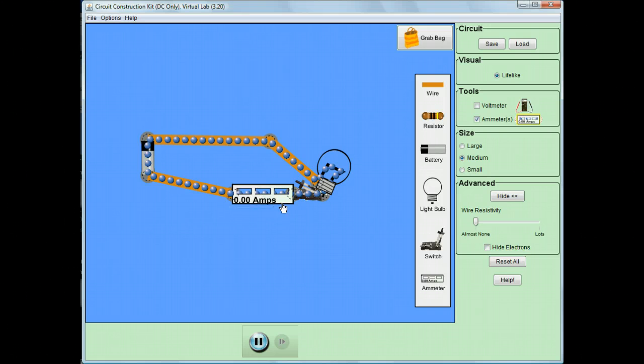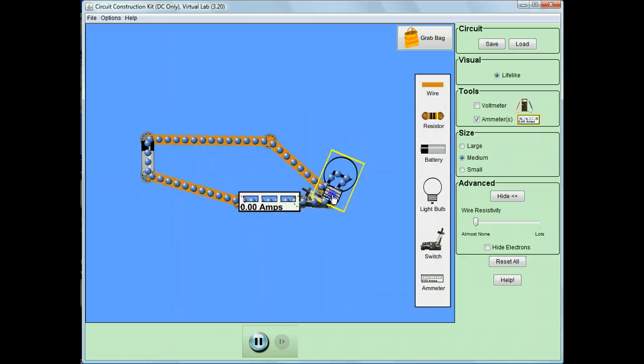One thing that you can't do here is change the resistance. What we want is for our ammeter to have essentially zero resistance. And if you think about this for a moment, I think you'll see why. If it has resistance, then that means it's going to affect the amount of charge that flows given a particular battery. And we don't want that to happen. Now in actuality, we can't achieve that. We can't make it so that it has zero resistance, but we can make it so that it has pretty close to zero resistance. So the hope is, just like how we often treat the wires as having zero resistance, we hope that the ammeter also has zero resistance, at least in comparison to the resistance of the light bulb.